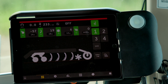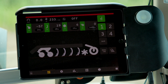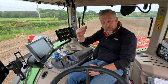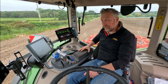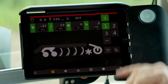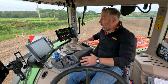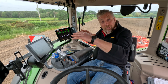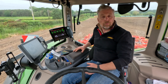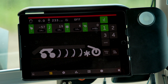Top left we've got kilometres per hour or forward speed. We've got our hectare reading, which we've never had on a top-down before. We also have a position indicator telling us whether the machine is in work or raised in the full lift position. On the top right we have our low-lift, and then one, two, three, four — our presets. We can preset our depths for any configuration of the four zones and store those.